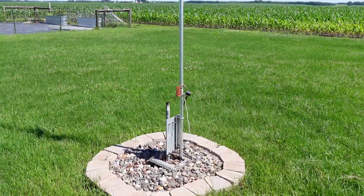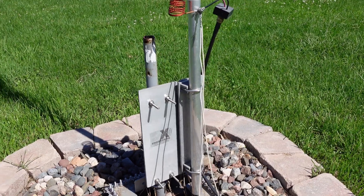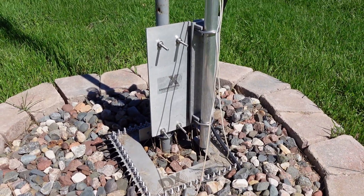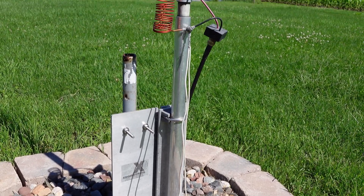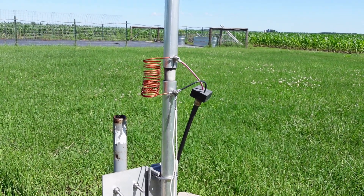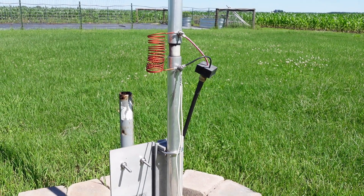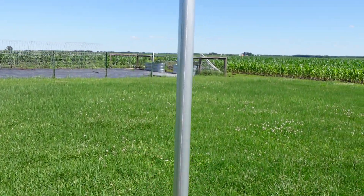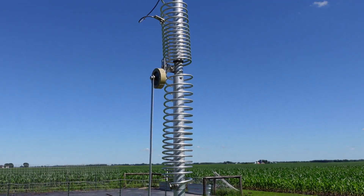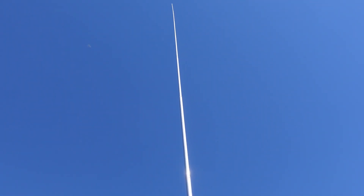Let me show you what it comes with. It comes with a two-foot pipe — the two-foot base piece there that you see clamped on. Then there's an insulator that separates the vertical portion from the base, which is the ground portion that goes to the ground plate. And then there are several sections that come together with little screws and nuts. It looks like nine sections vertical.